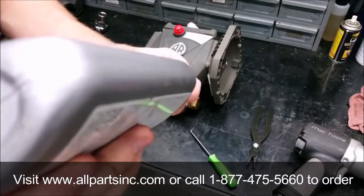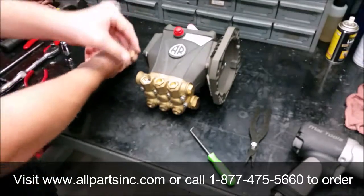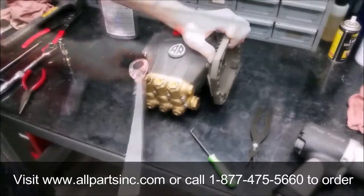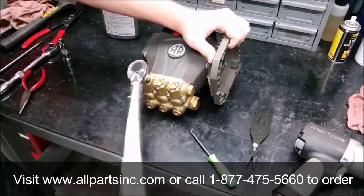To put the valve cap securely back on, you will need a drop of thread adhesive on each cap. Make sure the adhesive is medium strength. Torque valve caps each to 217 inch-pounds.